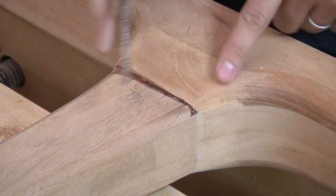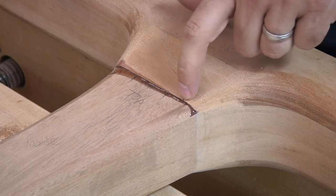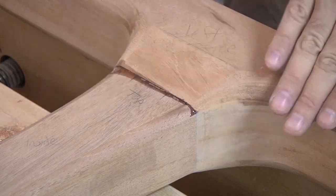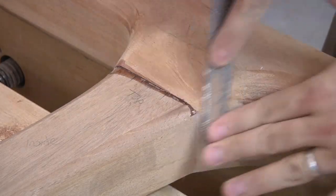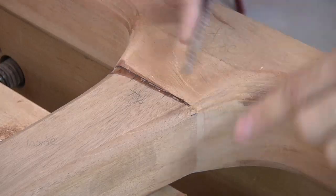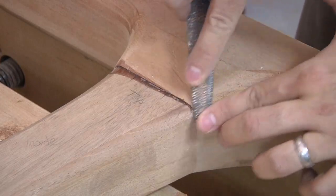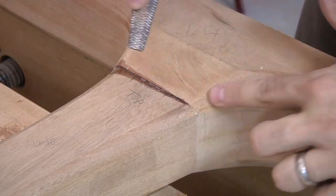Now I'd like to talk you through this process. If you look at the taper here, I've got glue here and this is sitting a little bit proud — my round overs are sitting a little bit proud — so I need to blend these in. The real key is to stop thinking of these as two separate pieces and think of them as one piece. If I just had one piece of wood with a little bump here, I'd probably start using my rasp to even that out until this round over is smooth. I have to be careful because as I push here I can start to really dig into my vertical piece. I'm going to very carefully work it and use the glue as my visual indicator on when I've removed enough material from this section.